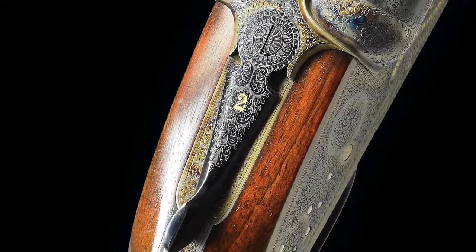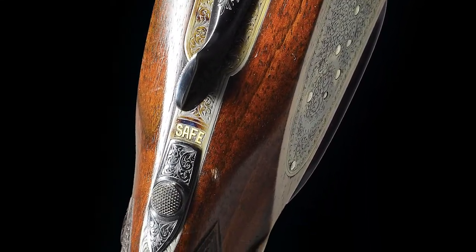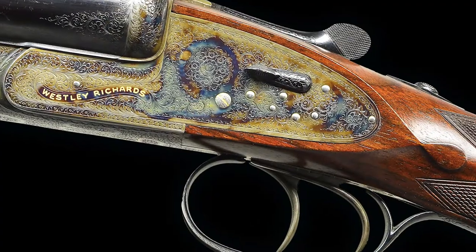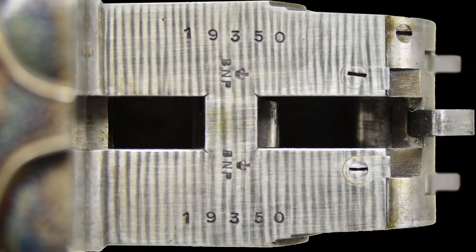The case-hardened sidelock actions are of a Holland and Holland pattern and feature automatic safeties, bush strikers, gold inline tumbler and cocking indicators, hand detachable locks, and double triggers with the front articulated. The water tables and breech faces are damascened, and Brown Brothers ABAS stamps can be seen on the rear lump wells. The locks are by Chilton, and the engine-turned interiors are also stamped ABAS.